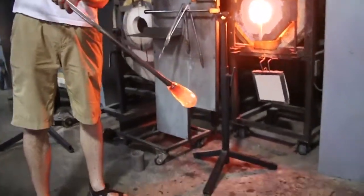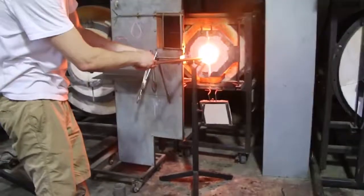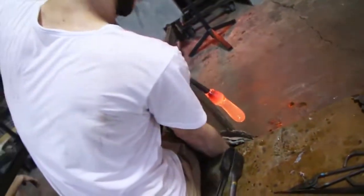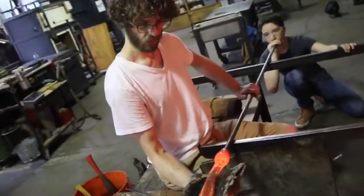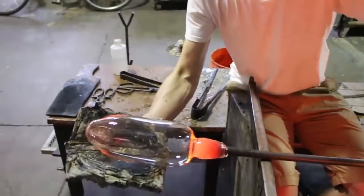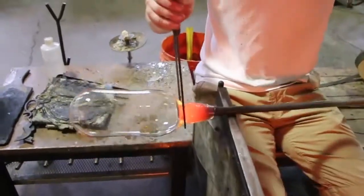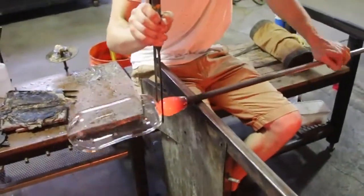You can see it stretching, see it moving a little bit — this would be a pretty good time to go for a drop-out move, but let's get it hot. Getting a big heat on it, heading back to the bench, going back to that really steep angle. You can see it dropping out and hourglassing. There I am with the paper, getting it ready. When I lift, I'm trying to keep that tip directly in line with the center of the pipe — not lifting and folding the glass in half. If you lift too aggressively with your hand, you're going to fold it. Everything has to be balanced, just pivoting off where that pipe is on the rails. I'd go back and watch this again and watch that left hand — that left hand is always key to what's happening with the glass.